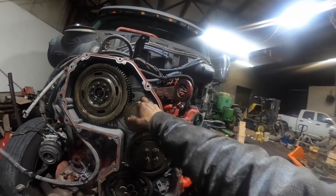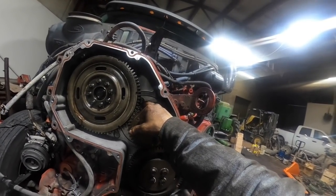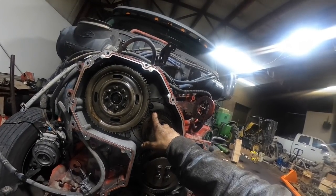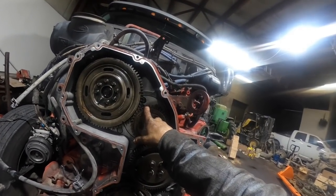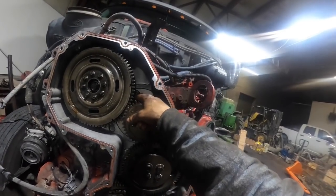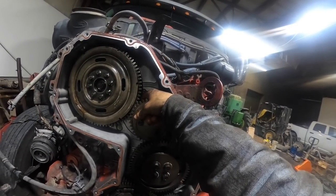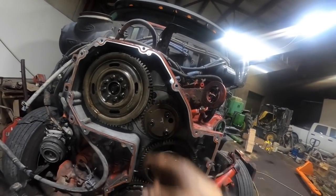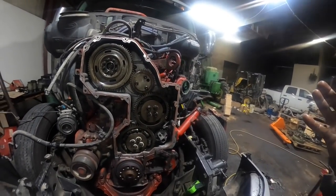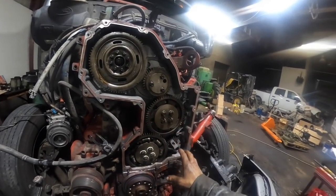And those plates back here, you want to make sure they're lined up the right way. It's kind of hard to misalign it, I think, to me, but anyway, if it was misaligned, they always tell you in the book, don't misalign it, because you'll plug up this oil drain hole in the head and the head won't drain the oil out of it. So I was explaining that to him, going over all that and how to set up the backlash. And I'm going to go over it here.